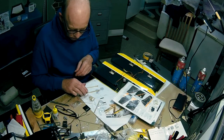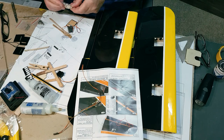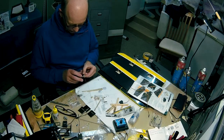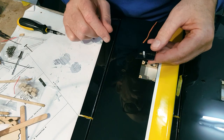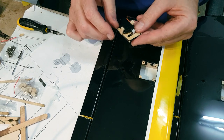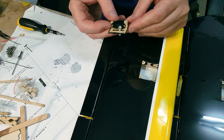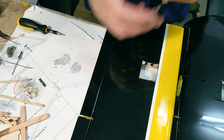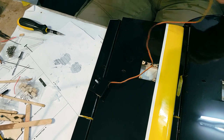Let's just get a horn on the servo and see how it lines up through the slot — I prefer to do it that way. I'm thinking I might be able to glue the wooden blocks on with CA, but only if they're not quickly cut. Let's assemble this lot and I'll show you an assembled one in a moment. The servo is mounted so it's got maximum deflection that way, which is kind of obvious really. I'll put the little blocks on and put the screws in. I might need to trim that block slightly because everything's too wide otherwise. So that servo has got to go in there — I'll do the same for all the others now.